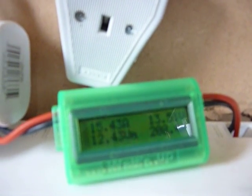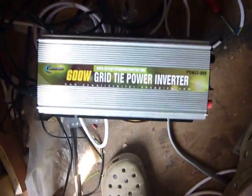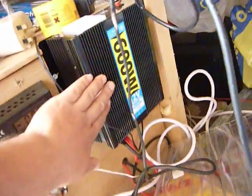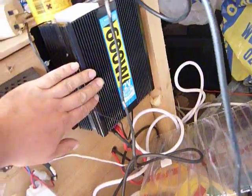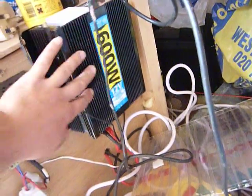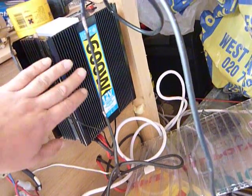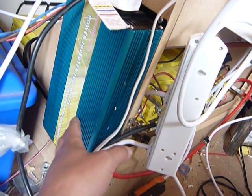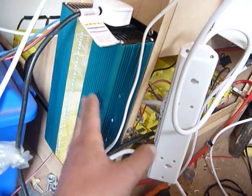Almost 16 amps and the battery voltage is going up to 13.50, so I'm going to have to turn this off soon. What I'd like to talk about is my latest addition which is a 600 watt grid-tie power inverter. There are lots of different inverters on the market — this one here is just a standard modified sine wave inverter, good for most things. But for computers and sensitive equipment you'll need something like this: a 1000 watt, 2000 watt peak pure sine wave inverter.